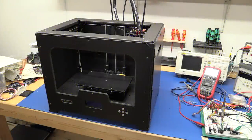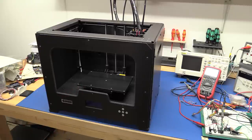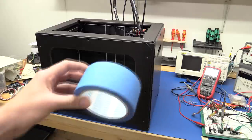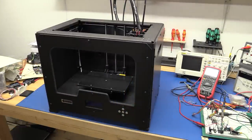This time I want to try out some PLA, and we will have to get the printer ready for that. As you can see there is nothing on the print bed there. In my previous video I tore the tape completely when I tried to remove the phone stand I was printing. I have printed PLA before, but I also used kapton tape on the print bed with glue stick on top to make the PLA stick. I have seen other people use painters tape, so I will try that this time, now that the kapton tape is destroyed anyway.